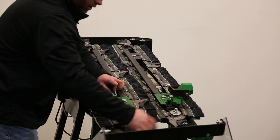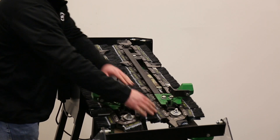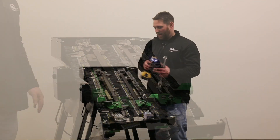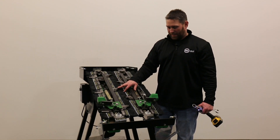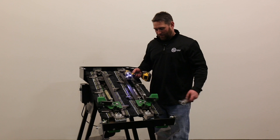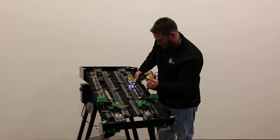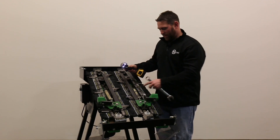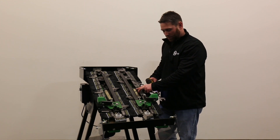You may have to get a pry bar to help you get around that bottom sprocket. That's what it should look like before we tighten them up. Now that we have our chains on and our crop lugs staggered, we're ready to tighten these up. Use 15/16ths on the tensioner. We're going to run these in until we leave about an eighth inch of a gap on our spring tube right here.